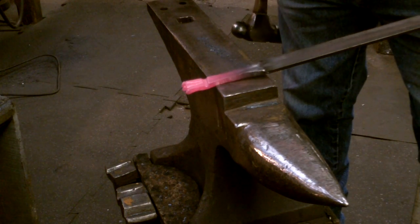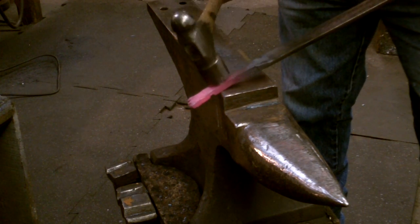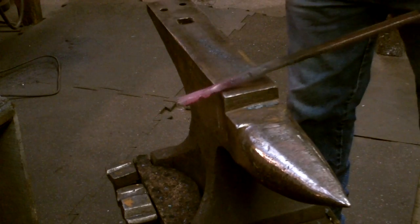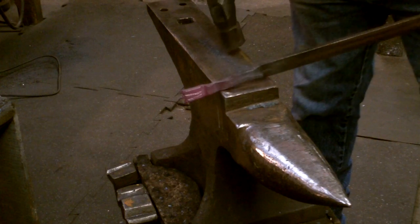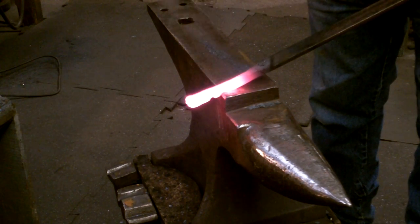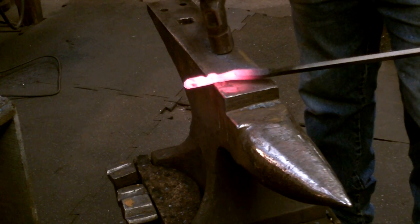With the detail facing down, I come to a rounded portion of the edge of the anvil, approximately 1/2 of an inch away from the rounded depression. I turn it over, pick my hand up, and drive a half-face blow into the material. Pull in snug. You drive about 2/3 of the way through the parent stock.